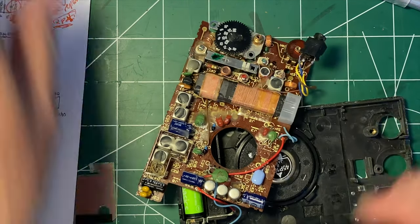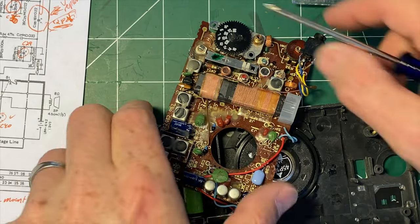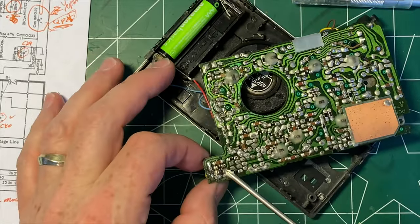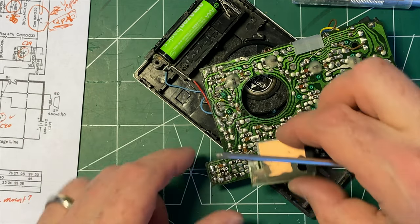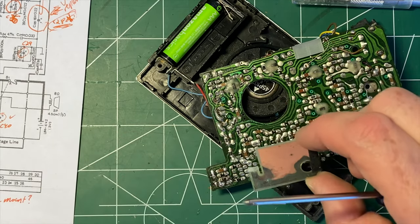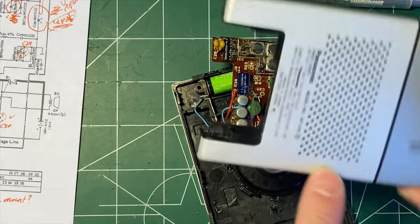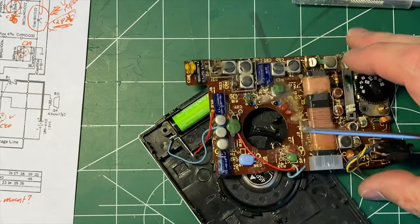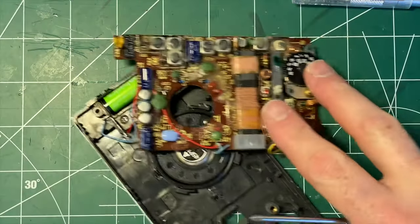I looked at the one in the amplifier — that one is in the amplifier so it's got to be fine; even if the ESR is a bit high, it's not going to matter for the amplifier. So I put aside my idea of changing more capacitors and went back to the schematic. One of the RF shields broke off; I should say I also re-soldered everything around there and checked and double-checked. It probably wasn't actually attached electrically — I'll shove a wire in it or something.